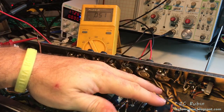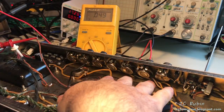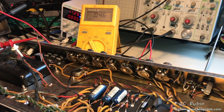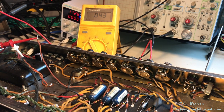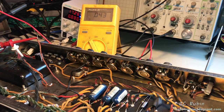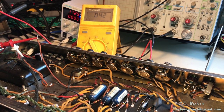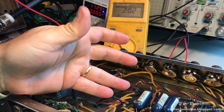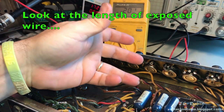We're doing so safely. You know, I could stick my hands in this amplifier. It is not connected to the mains power. So that is why this is an ideal way of working through these with a DC power supply when you have the ability to do so. Very quick test. Just puts that cable back in here and disconnects this cable.